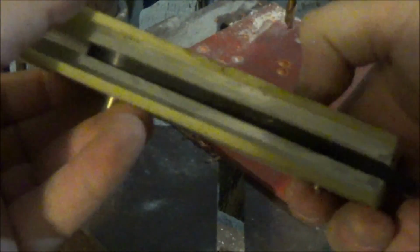It's obviously impossible to see the finished shape right now, but what I'm going to do is get the epoxy on the knife and the scales. I'm going to hammer in these pins, and then I'm going to clamp it to hold it tight, and then wait another 4 hours, and we're going to see this thing start to take shape. So, yeah, that looks messy, but it'll be fine when we clean it up.